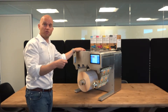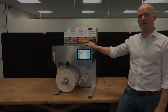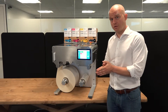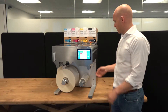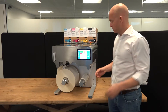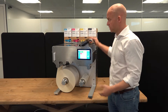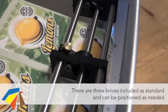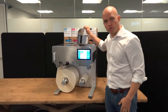If you want to print on thicker material, for example, you can also adjust the height of the printhead yourself. The Trojan 2 Compact comes with a 220mm wide printhead, which gives you the opportunity to print several labels across the media. We also put in a small knife system so you can cut them while running. So if you print four labels across the web, you cut four labels across the web and deliver four rolls ready to put on your label applicator out in your production.